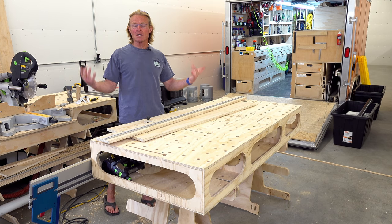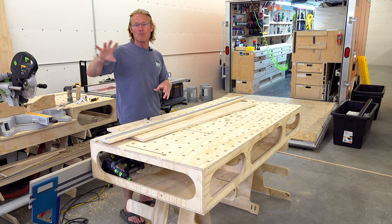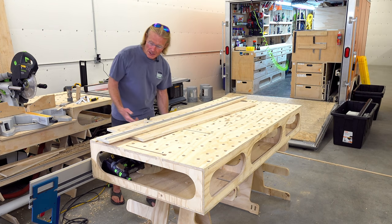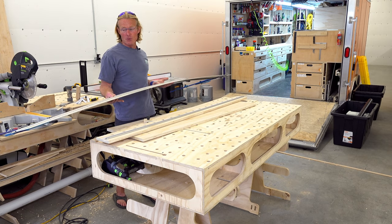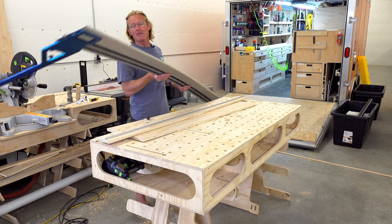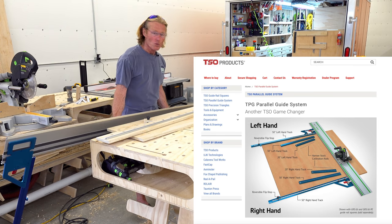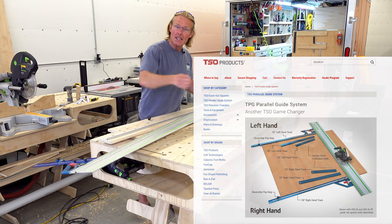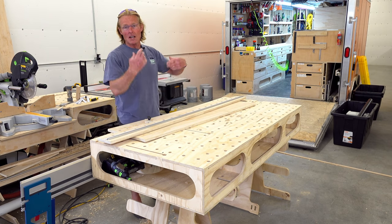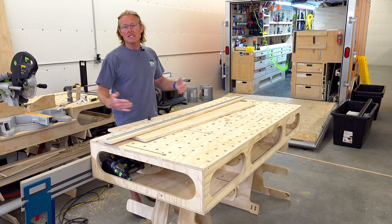I don't use big table saws, big sliding saws, and I don't use CNC. I make a lot of the stuff in the field. I want the accuracy you'd get with a big expensive CNC back in the shop, but in the field with my workbenches, the Smart Woodshop, and some great tools. I use my tracks — I have multiple size tracks. I use this long one for ripping plywood. I find this to be as accurate as a very expensive sliding table saw. I have these add-on TSO parallel guides and I just dial them in to the width I want, make the cut, set the piece down, and just keep going to get all my material ripped to width.